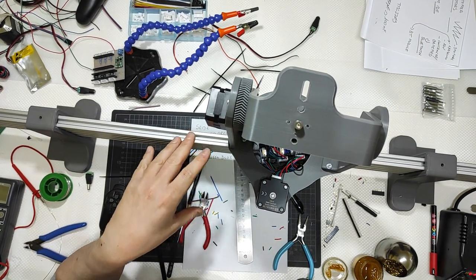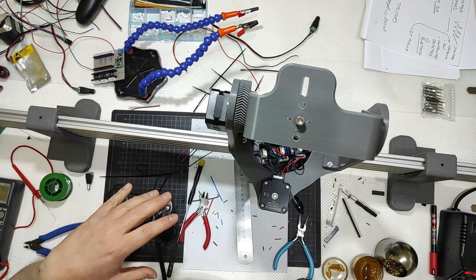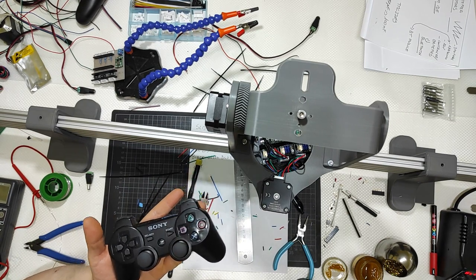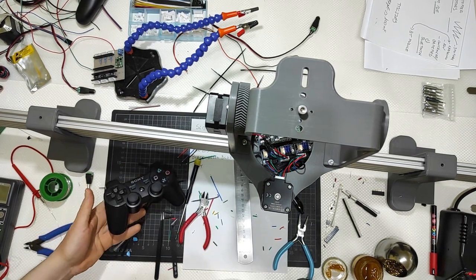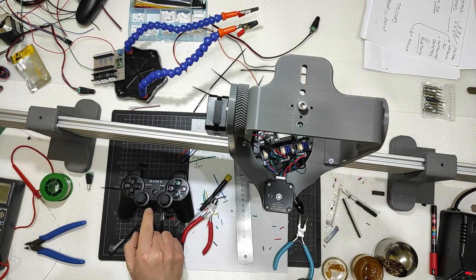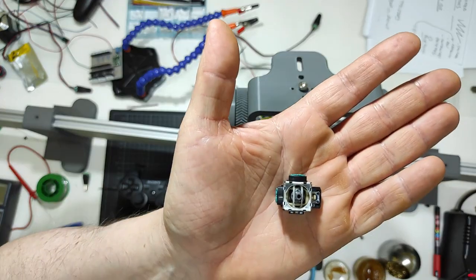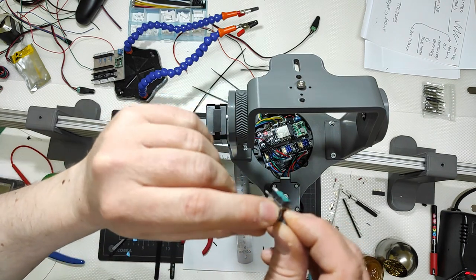This is commonly what you will find everywhere as programming for such things. In this case, for a pan, tilt and slide camera slider. In other cases, something controlled by a PS3 controller or PS4 controller. Every controller has this one that is old. Obviously, it is not new. I bought it second hand, but even the new one, the PS4, suffers from something called drifting. What is inside those two little joysticks? Inside there, you'll have a couple of ALPS joysticks, with one and two movements, with two potentiometers.